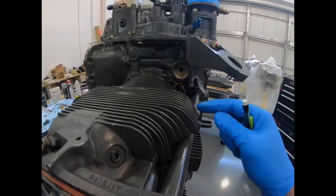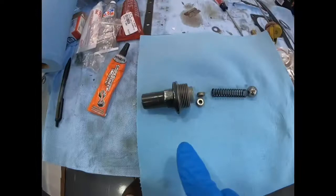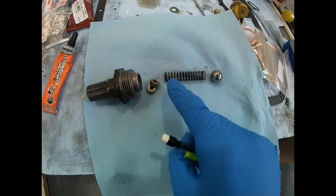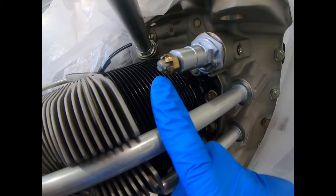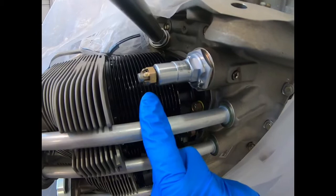There are two versions: there's a fixed one which we can adjust internally, and there's one that we can adjust externally. The internally adjustable one has a big ball, spring, and some washers in the housing. If it's an adjustable external type, it looks similar but on the end there's a wrenchable adjustment.